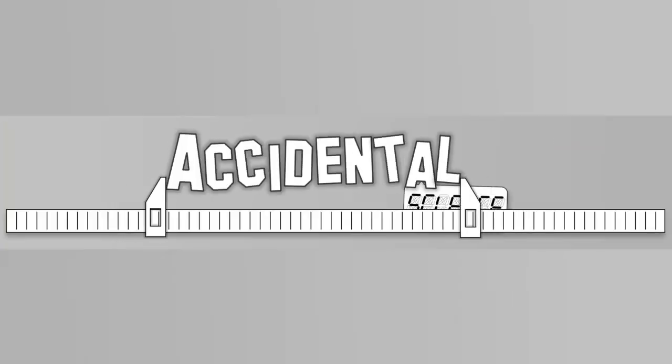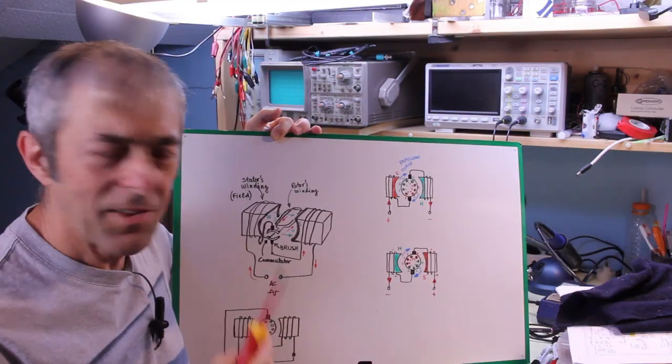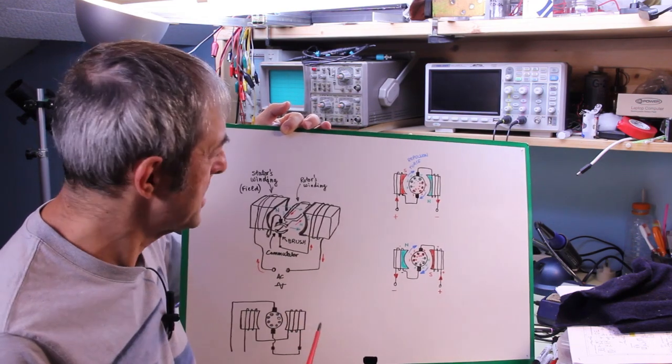Let's get started. The most used motor in washing machines, particularly the cheapest ones, is the universal motor. It is named after its ability to work both in alternating and direct current. Essentially, the universal motor is a brushed DC motor that has its windings designed to work properly at the grid's frequency and voltage. And the rotor and the stator windings need to be connected in series. This way, when the current flows through the windings, it generates a magnetic field that is always coherent between the stator and the rotor. And this is a simple explanation of how it works.